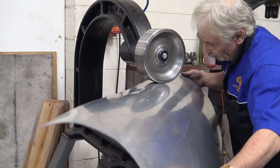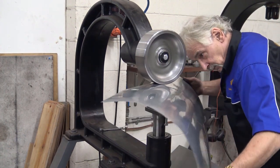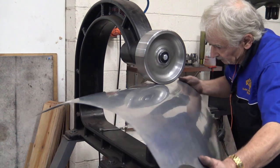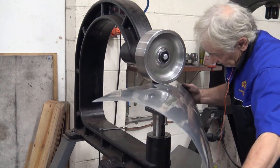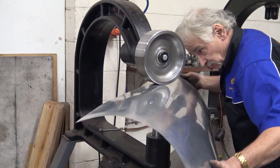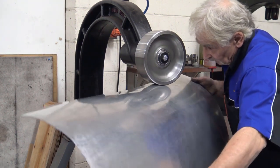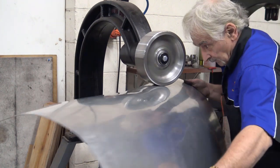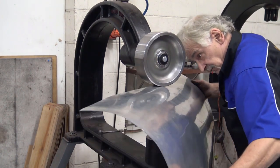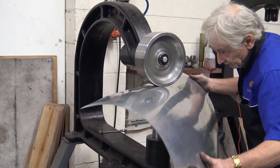And that's what I mean, see, we're on top of the blend here. There's going to be some marking, but later on, when we've got the patterns in there, we can then wheel exactly what we need to wheel. At the moment, I'm only roughing it up. I'm going sideways because I'm coming around and I've got a flat wheel in there, so that's where you see me going sideways, no other reason.